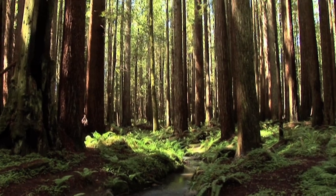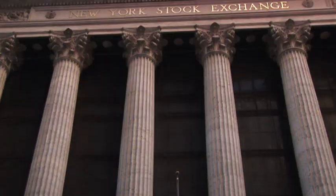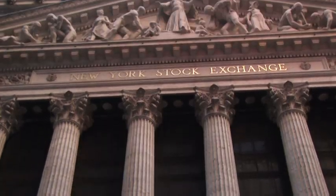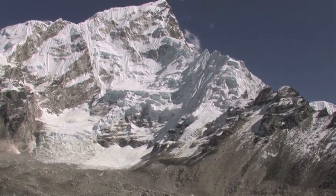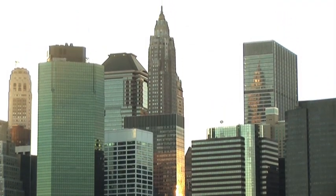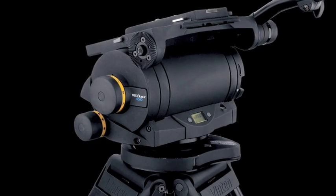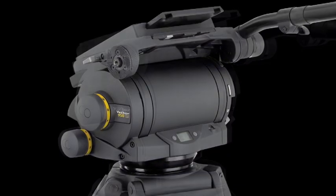The same thing happens when a camera is tilted. The further it is tilted from the horizontal, the more effort or torque is required to prevent the camera falling. If the camera operator has to make the effort to stop the camera from falling, they will soon become tired. This has led manufacturers of camera support products to create pan and tilt heads with a counterbalance system.